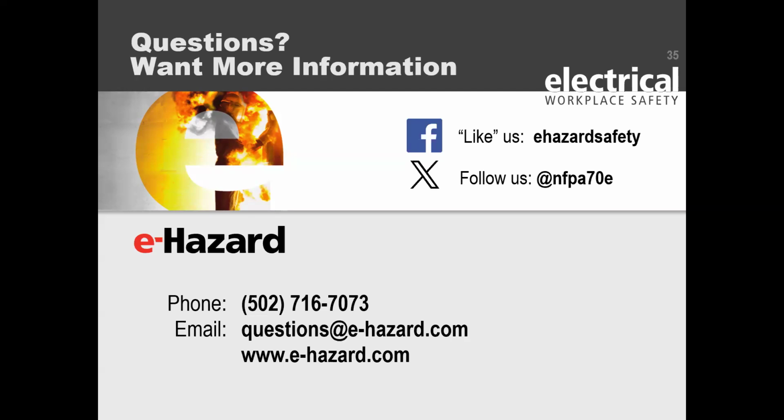First of all, Camilo would like to know how much incident energy can the combination of a rubber glove and a leather protector withstand? So from the testing that we have done, it's very manufacturer dependent. Also, the class of glove matters, but we saw leather protectors being able to withstand about 40 calories plus 55 calories per square centimeter with limited testing. We've also seen rubber insulating gloves, class 00, class 0, do about 30 calories per square centimeter when tested individually. When tested in combination, we've had values of 40, 50, 60 calories per square centimeter.